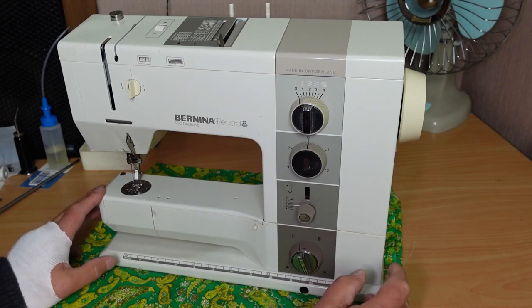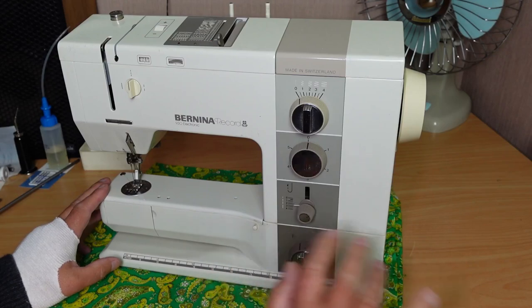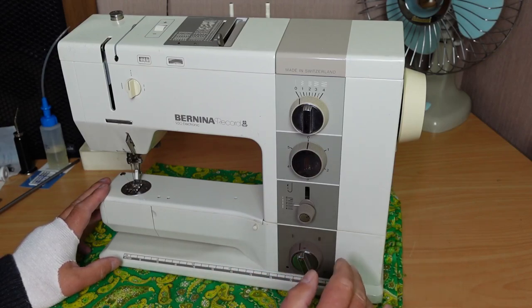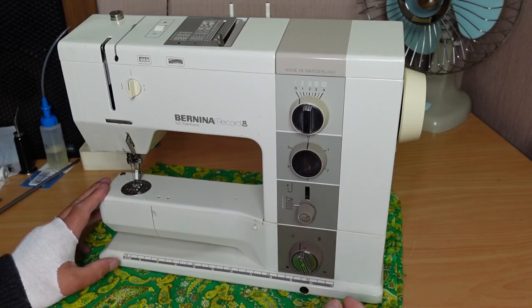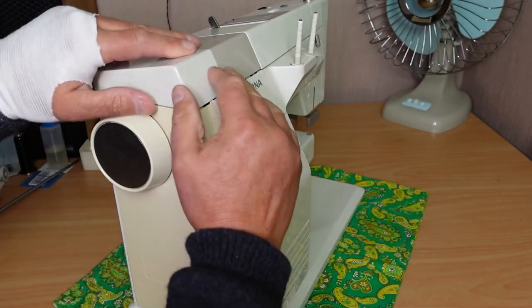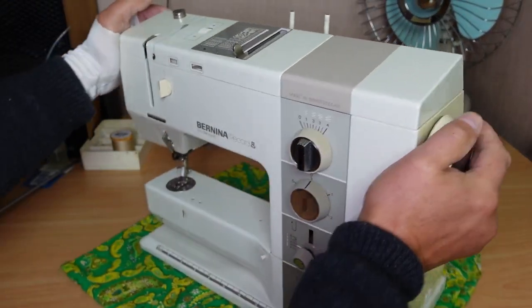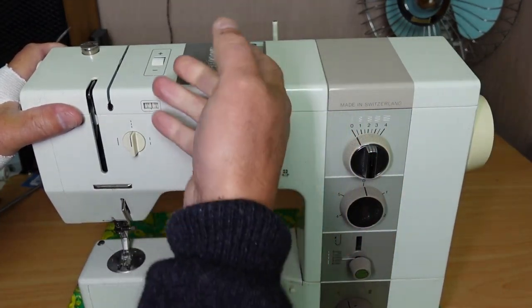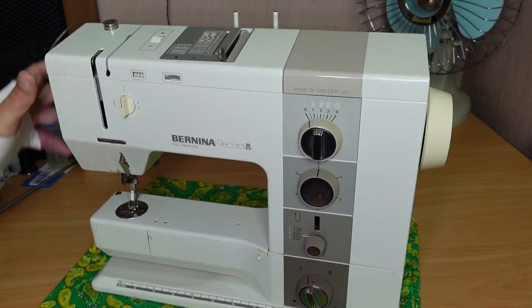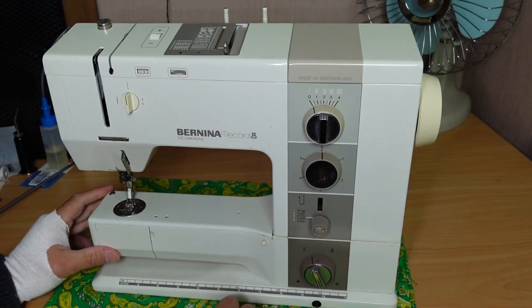The symptoms of a failing capacitor are a hissing, possibly sizzling sort of sound, maybe a little bit of smoke, or it could be an outright bang — not really a big explosion but a small bang, enough to give you a fright. Possibly a bit of smoke coming up through this area, up through here or maybe out the top. That's a surefire indication that the capacitor has blown or is in the process of blowing.